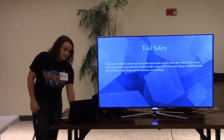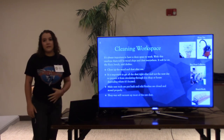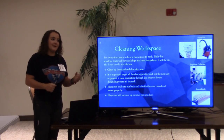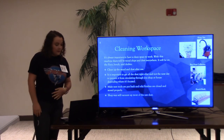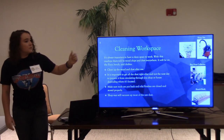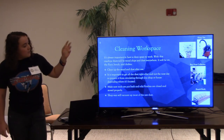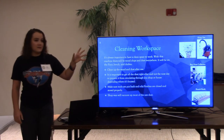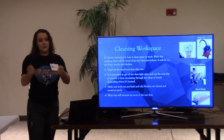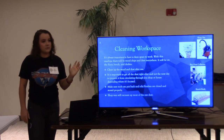Having a clean workspace was a major thing we covered in class. When you use the lathe — whether sanding or cutting — there's a lot of dust going everywhere, and as we know, wood catches on fire. Make sure everything is clean and chips are swept up. You can use a bench brush to wipe the bench into a dustpan. In our school shop, we had large bag dust collectors that connected to two or three machines — a good way to collect dust, but you need to clean them out by air-hosing them down outside every week or two.